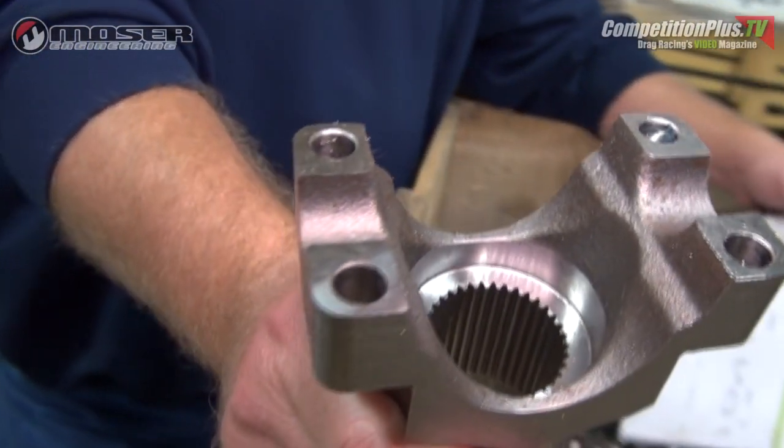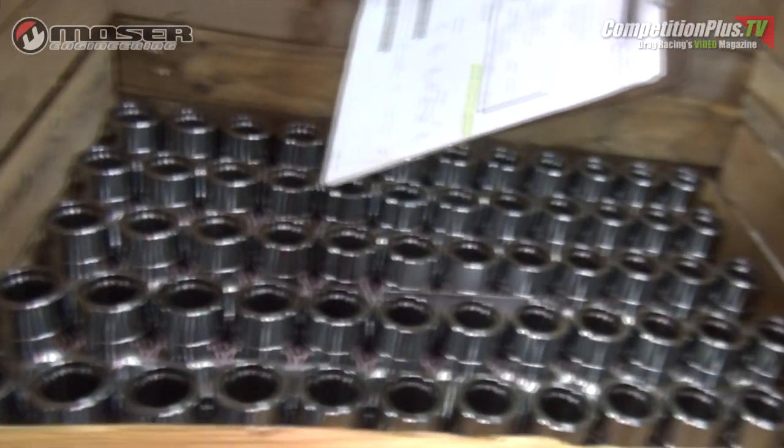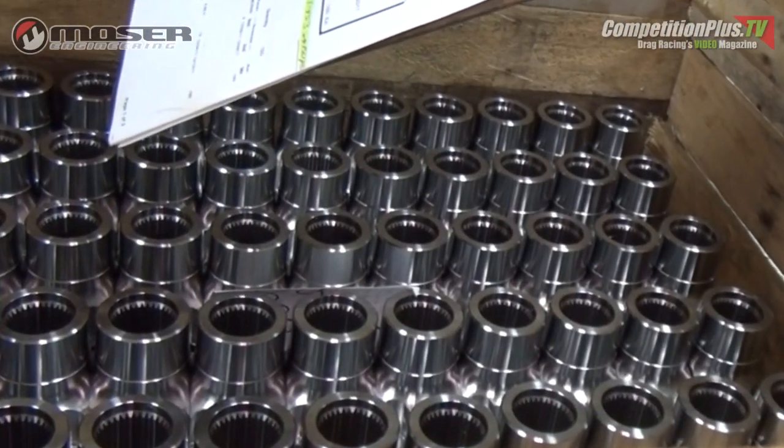And then it will come into our facility where we'll do the rough machining. It will then be sent out to be broached at a local facility, and it'll return to our facility where we will do the finished machining, make sure everything's true and that the part is running true. As a final op, it will come off of the lathe.